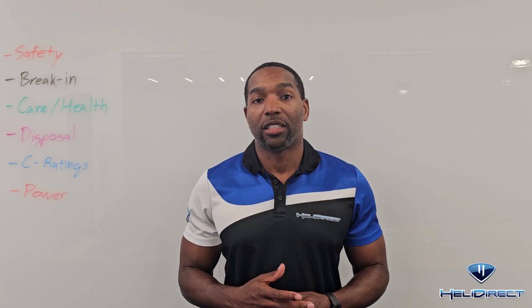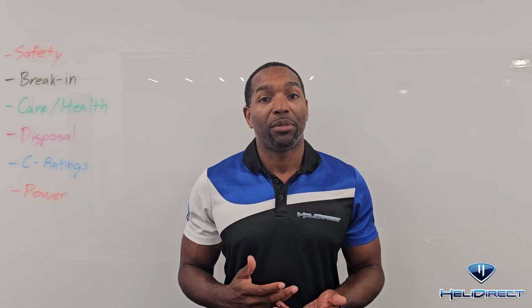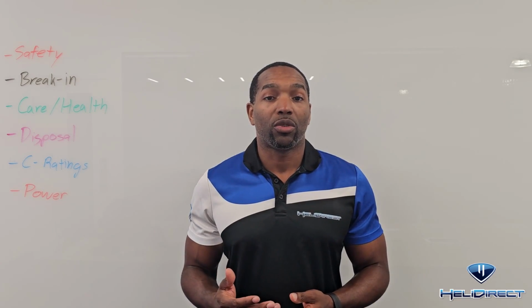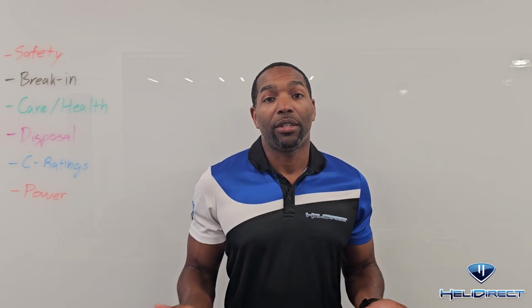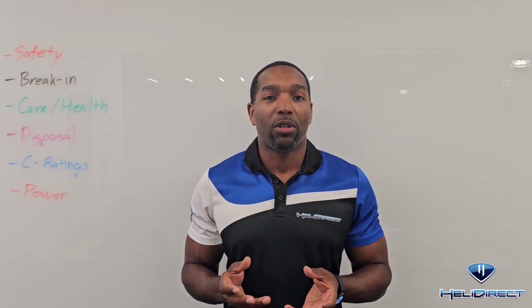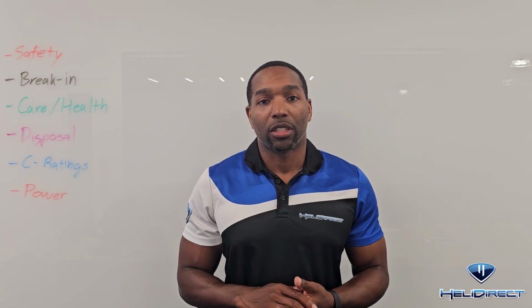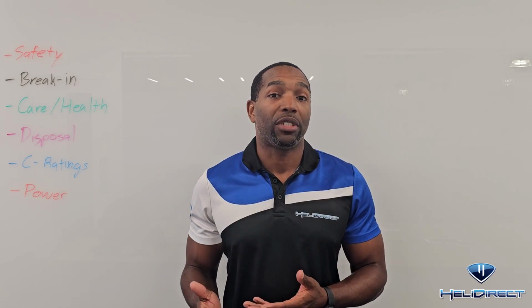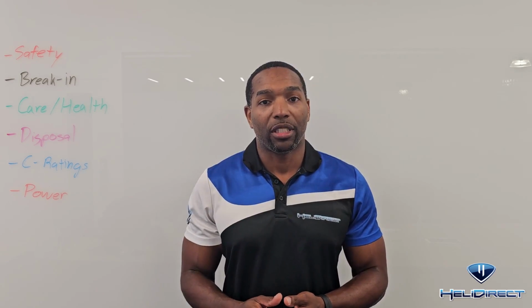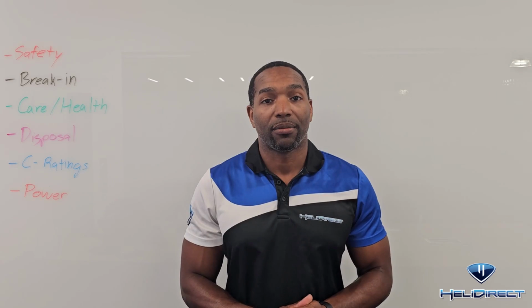Let's talk about LiPo safety. LiPo batteries are energetic devices, and I'm sure you've heard many stories of them catching on fire, not just within the hobby, but in consumer electronics. Stories where batteries have caught on fire after a crash, while they were charging, or being completely left unattended. Because of that, you should always have safe practices when handling LiPo batteries. Some simple things here, such as never let the battery get too hot, never overcharge them, don't damage the battery, don't puncture the battery, never charge them unattended, and when not in use, store them in a safe place.